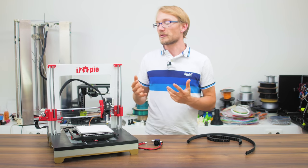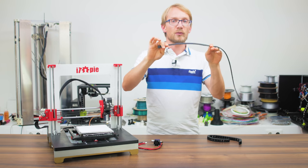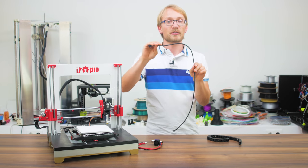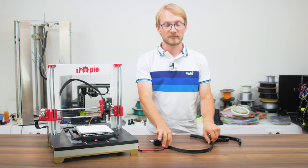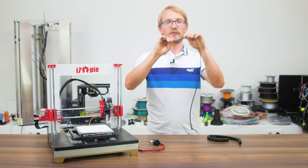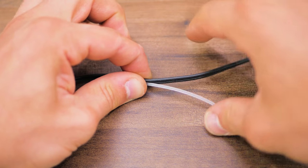Now, how do you route those cables to your components? What I see people doing is checking where the cable needs to be longest and cutting them to that length — which isn't ideal. You'll get a caterpillar effect and the cable might end up going sideways, down, or wherever. A better approach is to create an anchor point somewhere in the middle of the axis and route the cables there in a half-loop, so the cables are never completely stretched straight. You also want to make sure wires don't kink or flex in the same spot repeatedly, so the point where the cable is fixed to the moving and standing parts needs some sort of support — a bit of filament or the wire's own insulation if it's stiff enough.